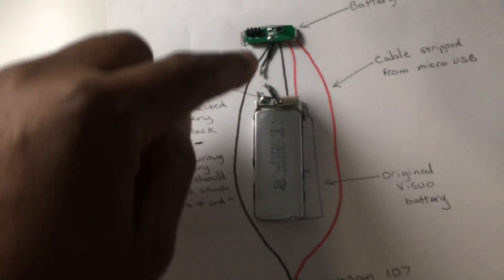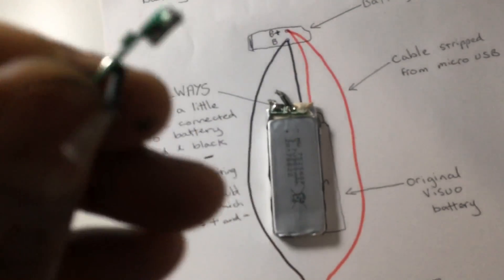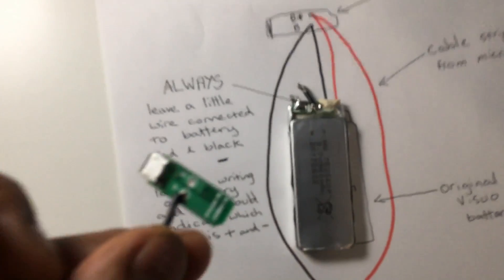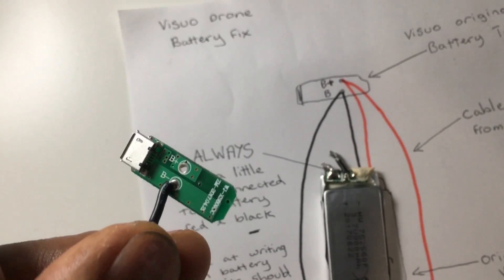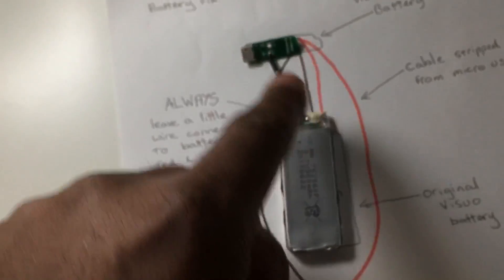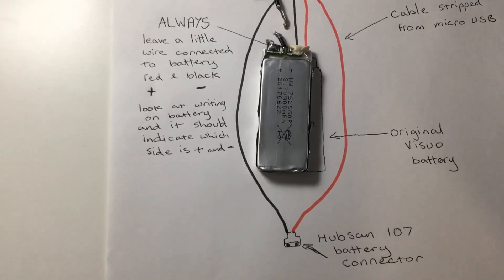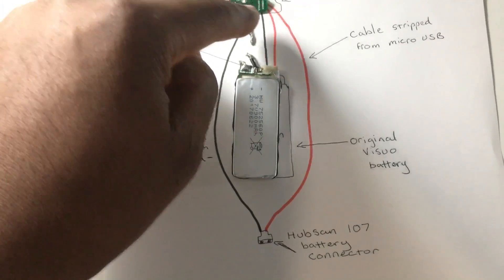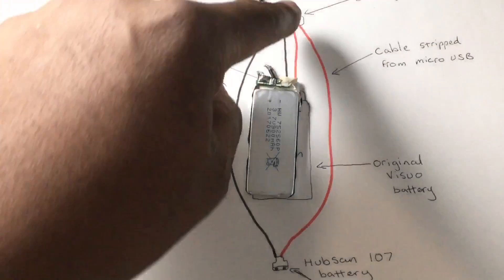When you open it up, leave your battery connected to the terminal via the red wire and the black wire. You can see I've got the USB here and the charging terminal. Look closely and you can just about see B plus and B minus on the chip. So you've got your battery, your connector, and the red and black wires. Strip down any micro USB cable — inside you should have one red and one black cable. Cut a few inches off, then solder a long piece of wire from the B plus, which is the red, and the same length for the black.